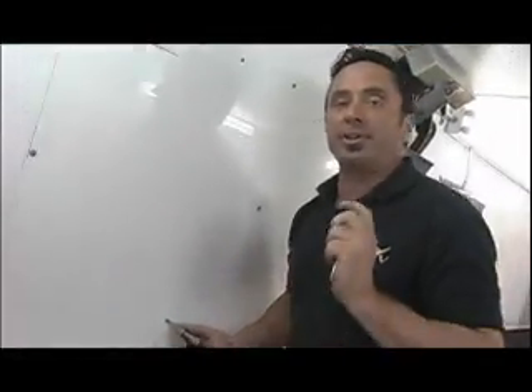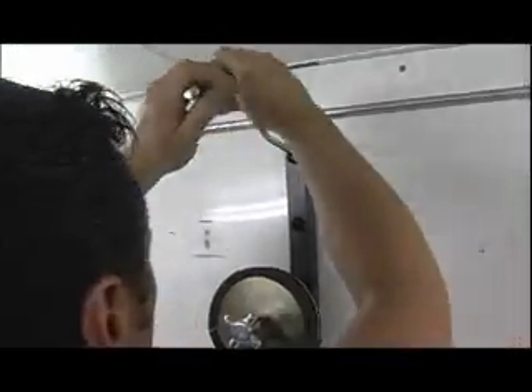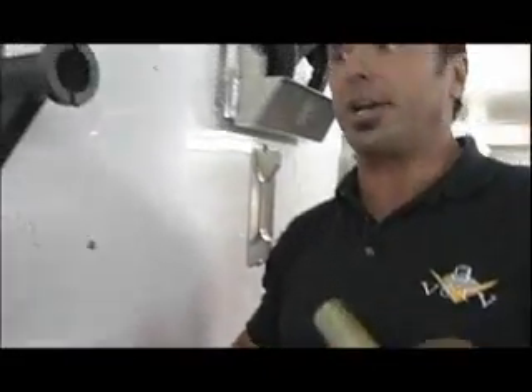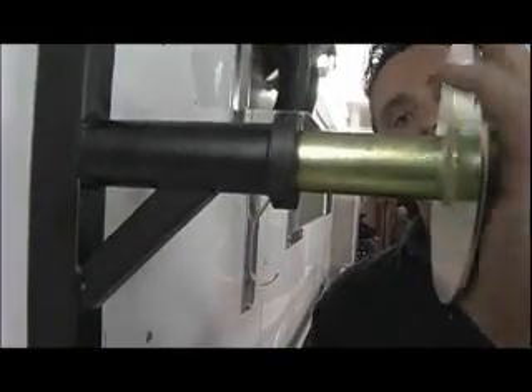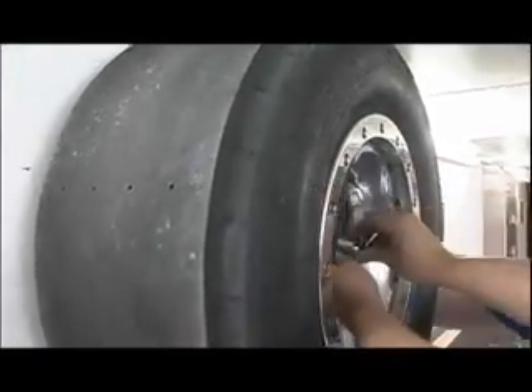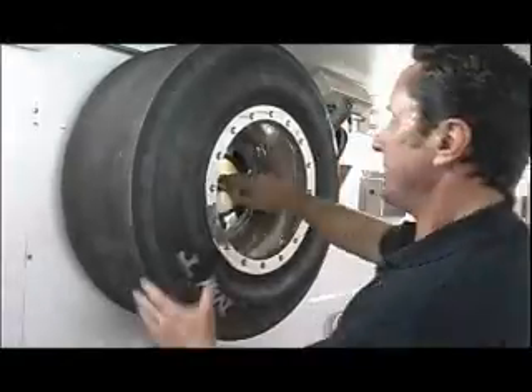Of all the things we've done here, mounting the slicks is probably the one that requires the most thought. It's very important that the slick mounts are mounted to a stud — you don't want them hanging on just sheet metal and you don't want it screwed into wood. You'd really like it mounted to something metal because there's far too much weight; the tire and the mount itself are heavy and you don't want to find it on your car after a long drive. We've pre-drilled all the holes and we're tapping them so we can screw right into the wall. The hub can slide in and out for any backspacing rim — slide it in, get it to the backspace you need, put your slick on, and it's as simple as that.